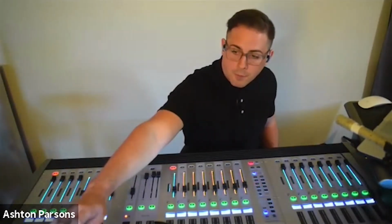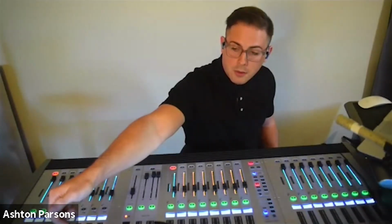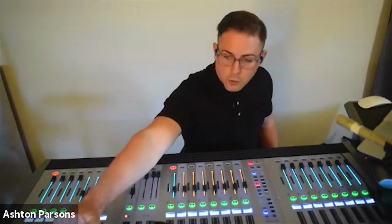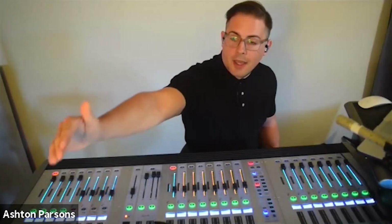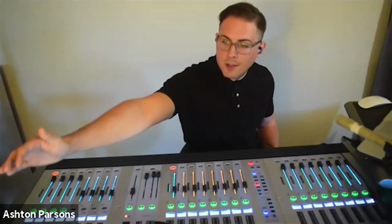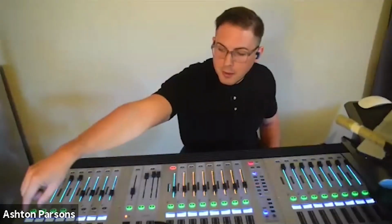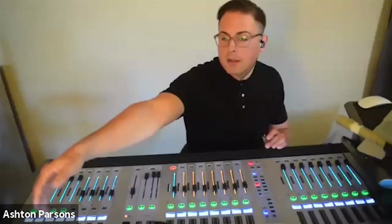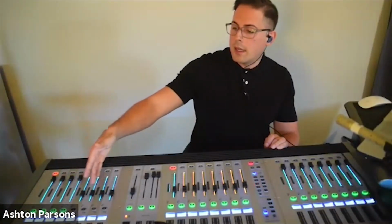So on the first line, in the same set of knobs where you saw your type select, you've got your source select. So we'll click the little plus sign here, and in front of you you'll have mix left, right, center, and then all your aux sends, but you can also set up local, stage, rack, direct outs, etc. But in this case we're using aux send, so I've got Ali, Lauren, Dinah, and Normani set up here.